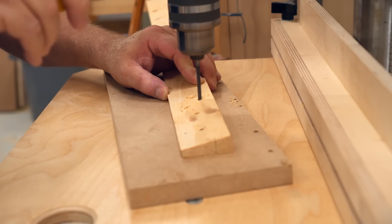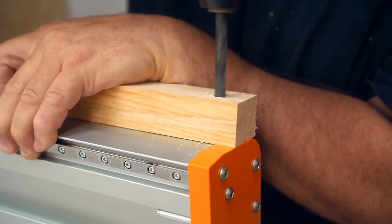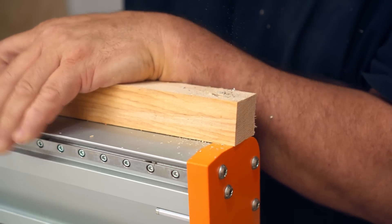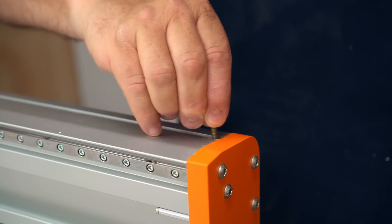The top of the gantry is not actually flat at the back — it slopes down — so I'm going to cut an angled strip to fit on top of there. And to fasten it to the gantry, I'm going to open that slot on the end so the heads of the bolts will fit in there and they'll be sticking up.